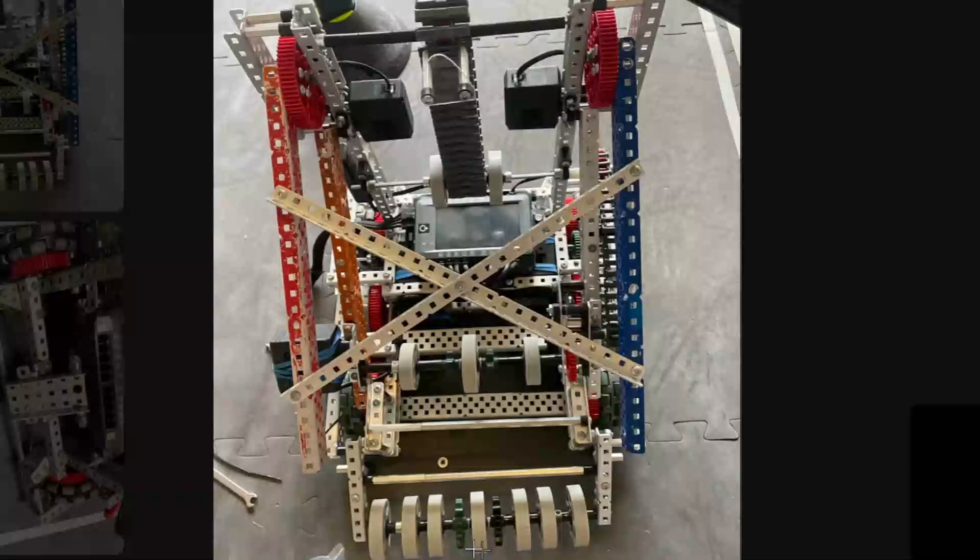Looking at this photo, your pre-roller is going to be destroyed - it's so far out and there is barely any bracing. First thing I'd do is either move it back, or put a C-channel over it and triangle brace it, or do both. No matter what, you would want to have a C-channel up here and triangle brace it with plastic or whatever. You've seen that quite a few times on here already. And it's not like he doesn't have plastic - he has plastic here, so just do that.